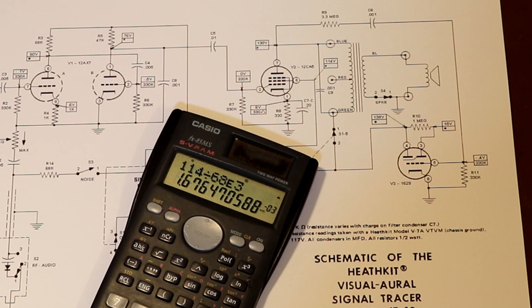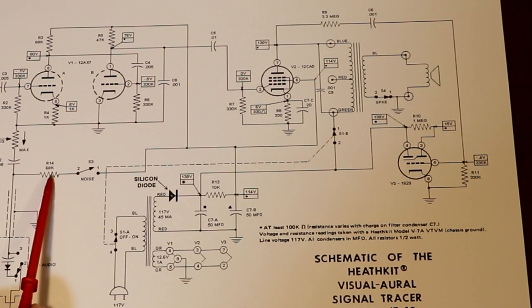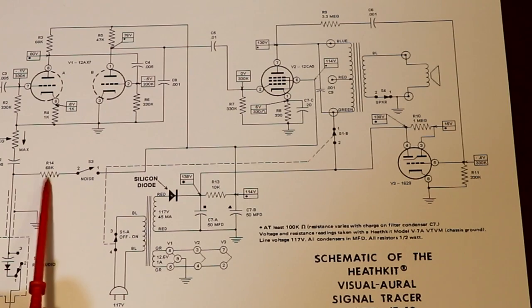Well, I'm not sure, but I think you're going to feel 1.6 milliamps with 100 volts behind it. I think you are going to get a tickle from that. It just kind of shows that back in the day, they weren't afraid to give you a bit of a buzz, were they? So it's obviously very important that we check that this 68k resistor is 68k or above. What we don't want to find is that it has gone low in value or short circuit, because then we're going to get no current limiting and you could probably receive a really nasty shock from the tip of the probe. As it is, you'll probably just get a tingle, but without that resistor in place you could get a really nasty belt, so we need to check that.